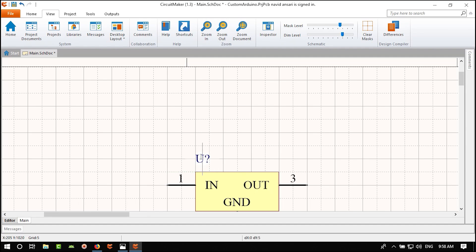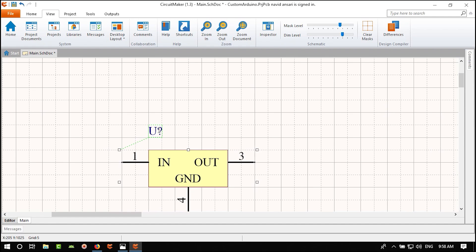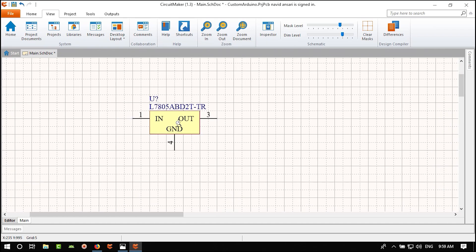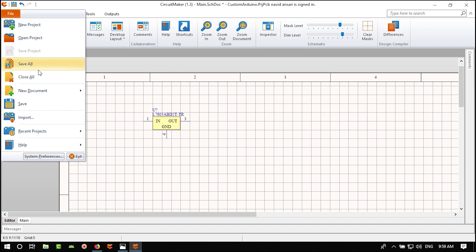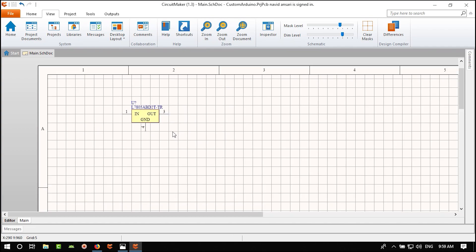I found one — this looks like an SMD DC jack. To tell if it's SMD: in the footprint preview the SMD version shows only red pads, while through-hole shows white outlines with holes in the middle. For the DC jack, though, it's better to use a through-hole component because there is a lot of mechanical stress from plugging and unplugging.